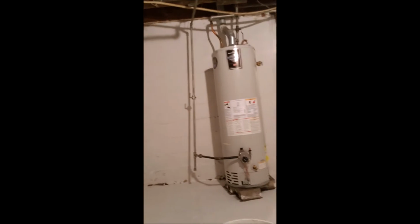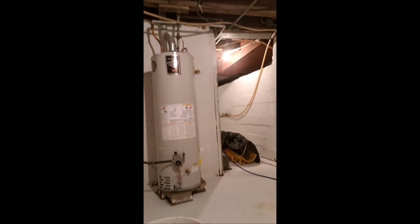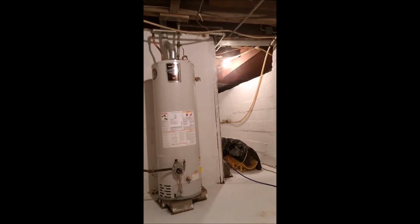Basically, it's ready to go. Like I said, here you can see I've got the walls pretty well started. It's just first coat. I haven't done any of the brushing. Like I said, when I had issues with the sprayer, I was already ready to work, and it was early in the morning yesterday, so I just went ahead and put the first coat on. Normally you would want to spray first since it's on the ceiling, but it's a 2-coat deal, so any little overspray that gets on the walls will get covered with the second sealer coat on the block.